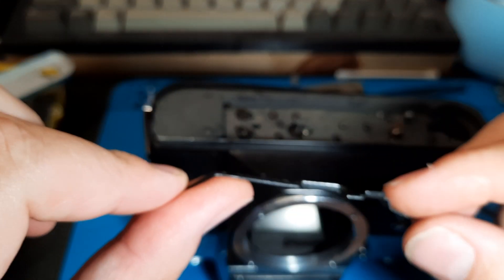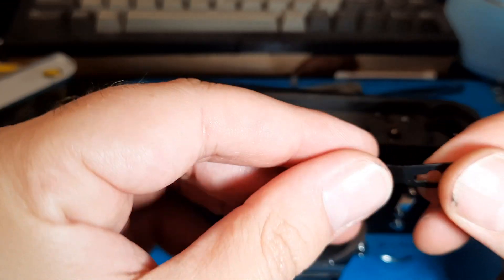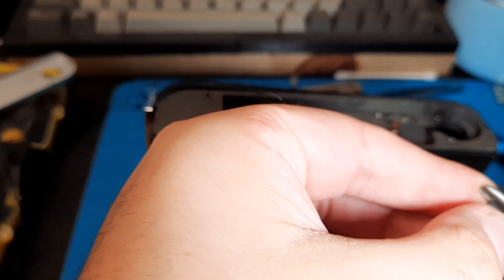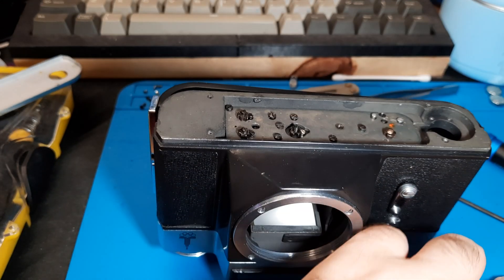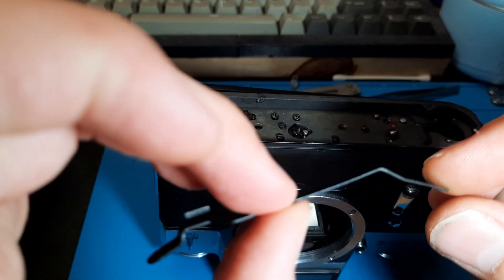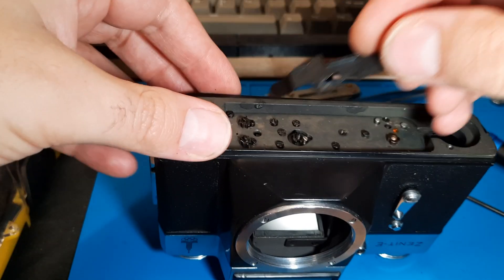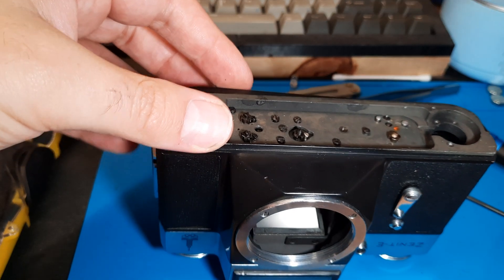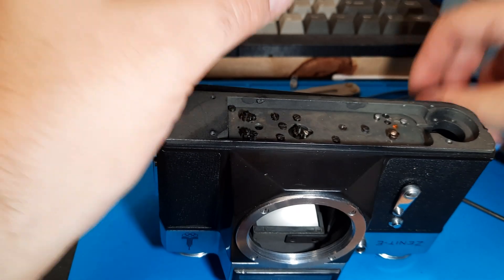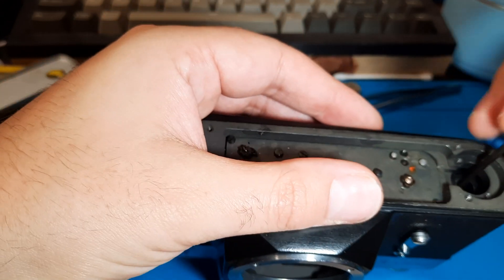That's why this thing being in alignment is actually kind of critical. It does look like from factory they have that, but what I tend to do is get pliers and just bend it back a bit more straight on the desk. This stuff's quite thick for its size but we've managed to bend it back a little, and that'll usually be enough. The tensioning on these is fine so these don't need touching. Getting this back in is a bit fiddly — don't put that back yet; you'll want this bit in here. Let's put the shutter rod back in.